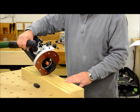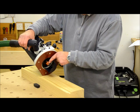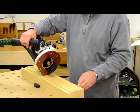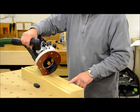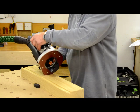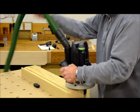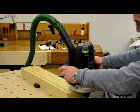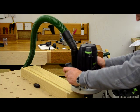I'm going to do another cut now, this time using a rather pretty cutter which is installed already, and I've put the chip catcher in place. I'm going to run this beading cutter down the edge of this piece of hardwood. I've got my dust extractor connected, I've got my height adjusted properly, and within a second or two we'll be ready to go. I've already set it down in the plunge position — because it's a beading cutter, I don't want to plunge into it — so here we go.